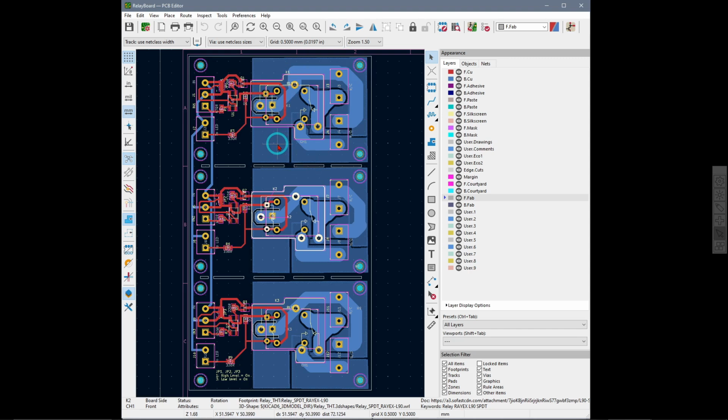And these inputs are separate, but I did connect the power, the +5 and the ground together via these traces over here, the blue ones. But of course, if you cut them, these are slots, makes it easier to cut them apart, separate them out. Then of course you would have to apply the voltage to the pads on these connectors over here. So whatever you think is appropriate.